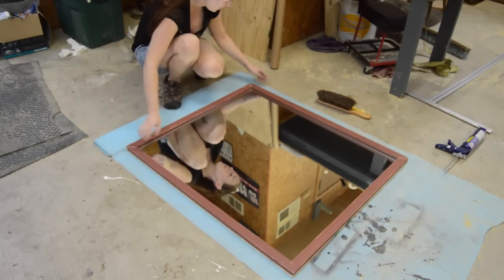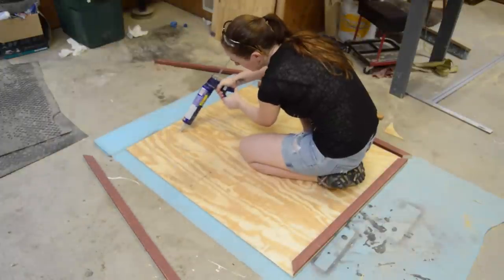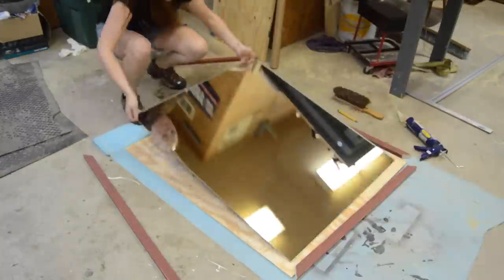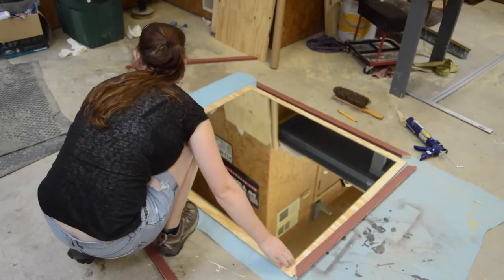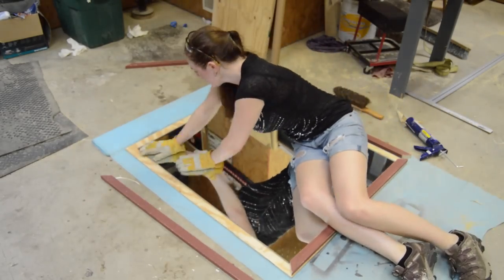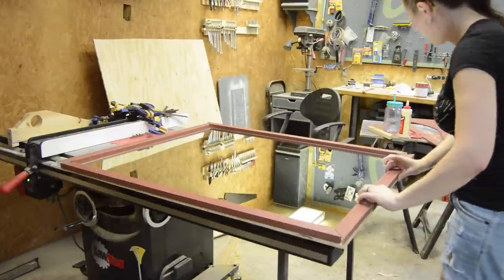Next I cut a back from quarter-inch plywood. I set the piece of glass in its place along with the miters, lining it out where it was going to need to be. Then I traced it out and moved the glass aside, and was able to use liquid nail mirror adhesive to attach the mirror to the backing. Finally moving up to a bench top work surface, I started gluing on the frame.